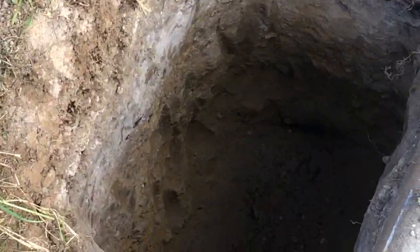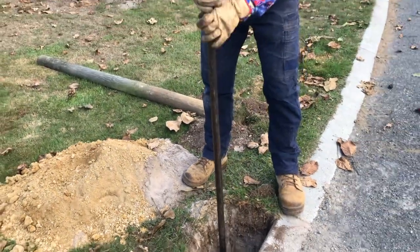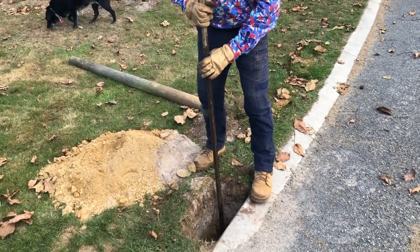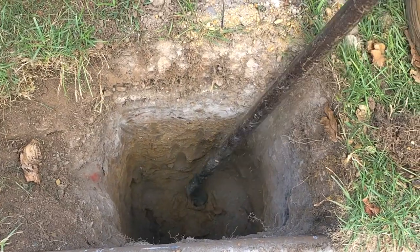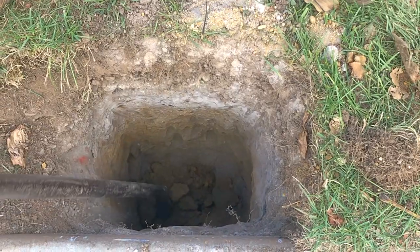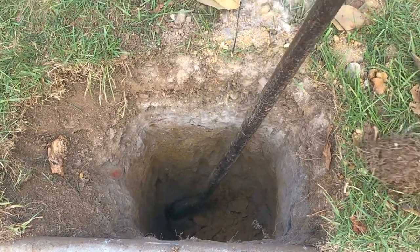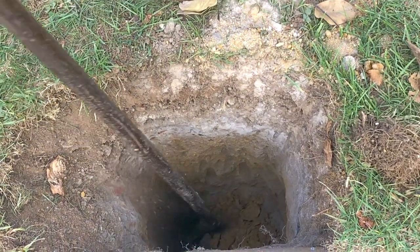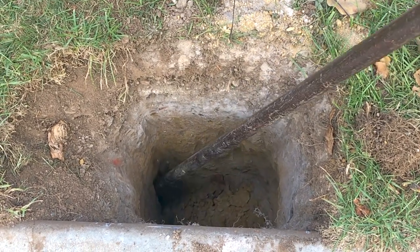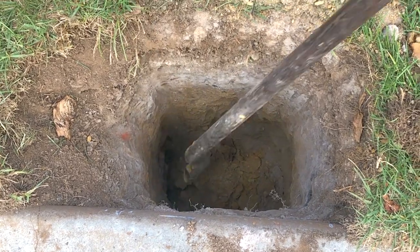Unlike a post hole, I've actually created a square hole because that works easier for the shovel to clean out if you're digging manually. So the first thing you do is right in the middle, you just sort of work the bar around and you actually break out the middle. Got to get in the right spot, lever that away. I've got a little bit of a piece broken out right in the middle, and then you work in towards the corners. Now you can see how this bar is working really well. If I want to break this side out, I can go in close — that's the normal way — but then turn the bar around and jam it right in there, and you see how that just levers that right out at the bottom. So it works fantastically for keeping your hole square.